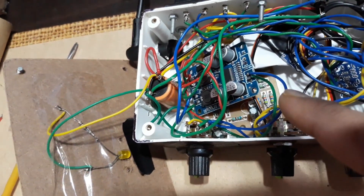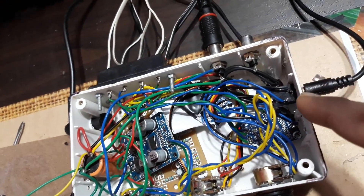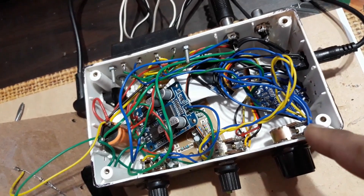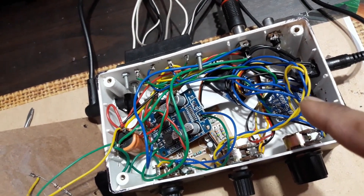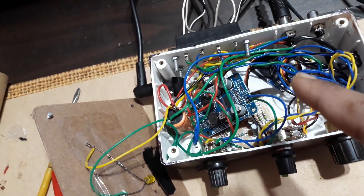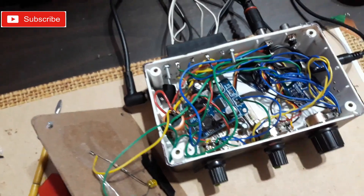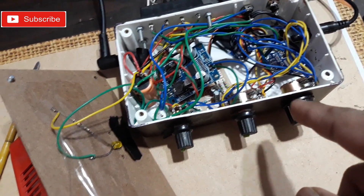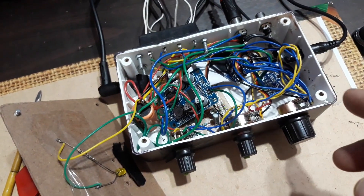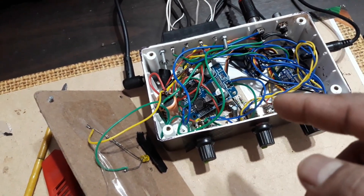At the bottom you can see a subwoofer filter. I have connected this AUX socket — that's the audio input coming from the PC — and from there it goes to this volume control. From this volume control it goes to this kit and also to this second volume control, and from there they go to that kit, that filter, and that kit too. So it has become the main volume control — I just need to adjust the secondary ones to a certain point, and increasing this one will increase and decrease all the volumes across all channels and the subwoofer.